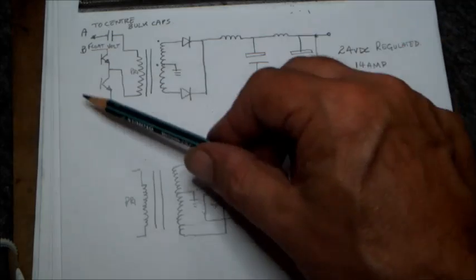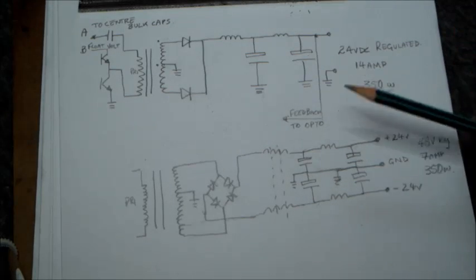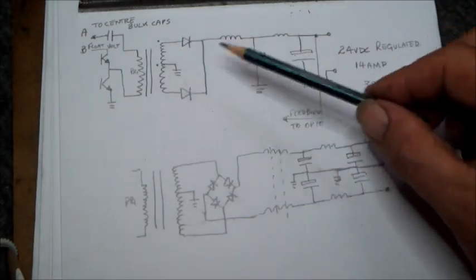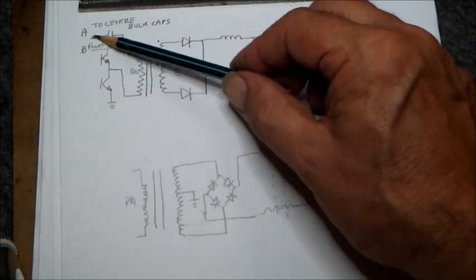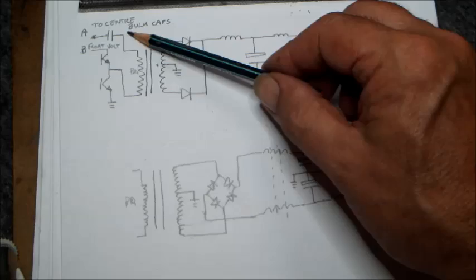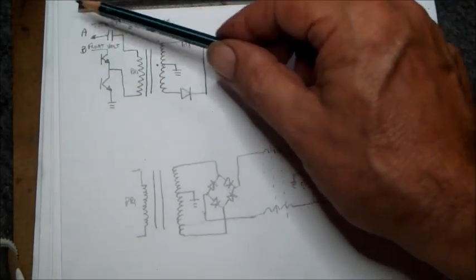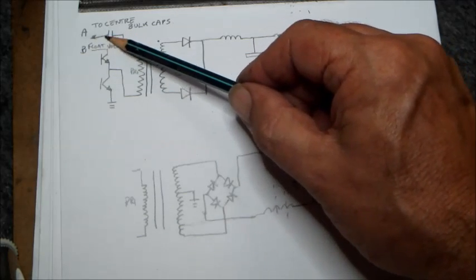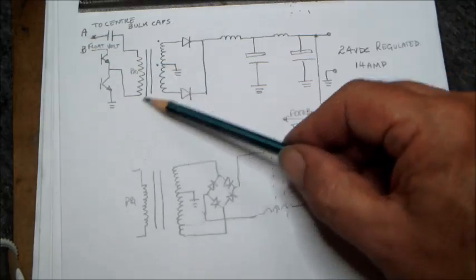Okay, here we have an arrangement and possibilities that one can have with the transformer I have explained. Here is a brief description of the primary and the output transistors, with the small capacitor here, the 1 microfarad usually found, and this goes to the center of the bulk capacitors, and providing here on this line about 155 volts, and this goes to the floating voltage anyhow.